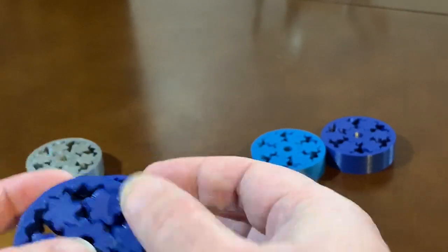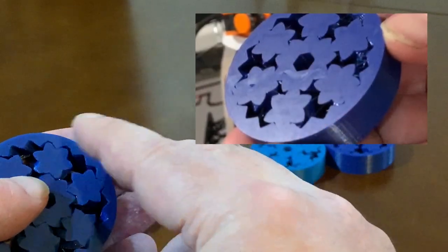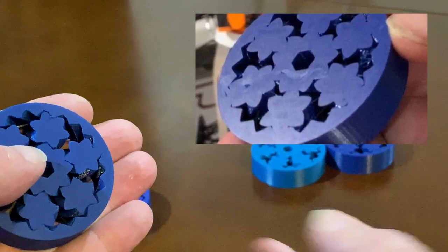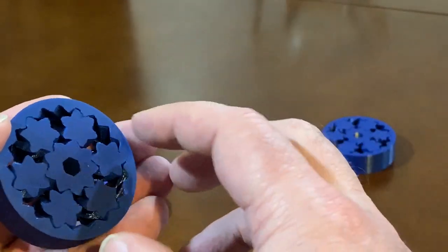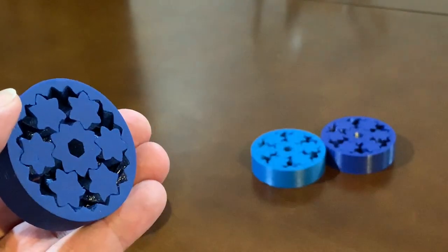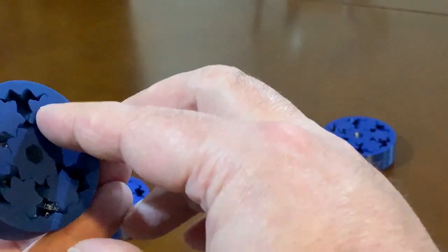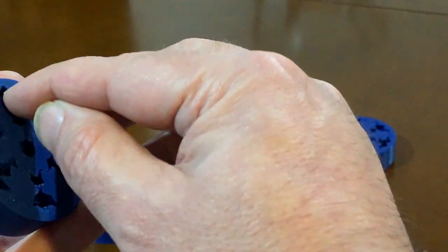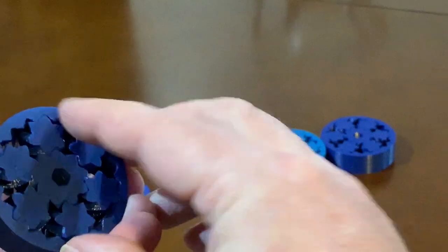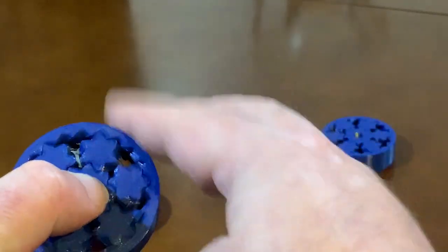It works - I was able to get it loose - but the bottom layer was completely fused. My Z-axis was too low for PETG. I had set it for PLA and I'd been printing with PETG and getting away with it, but I had a lot of parts that either fit together with difficulty because the bottom layers were too big. There was a little bit of an overhang where the wall is supposed to be. Through a bunch of cutting with a knife and some sanding, I was eventually able to get this one to work pretty good, but nowhere near as good as the PLA ones.